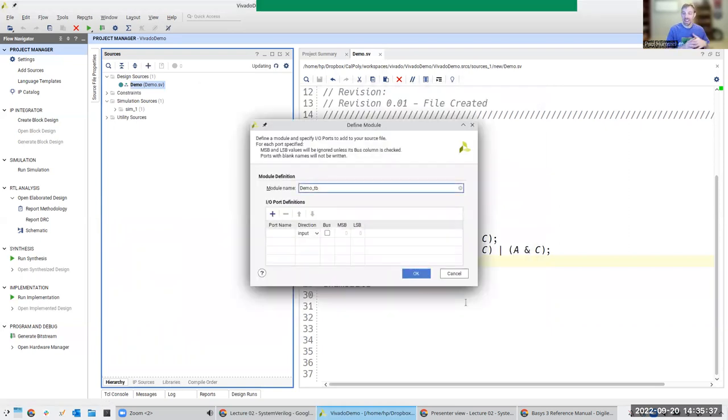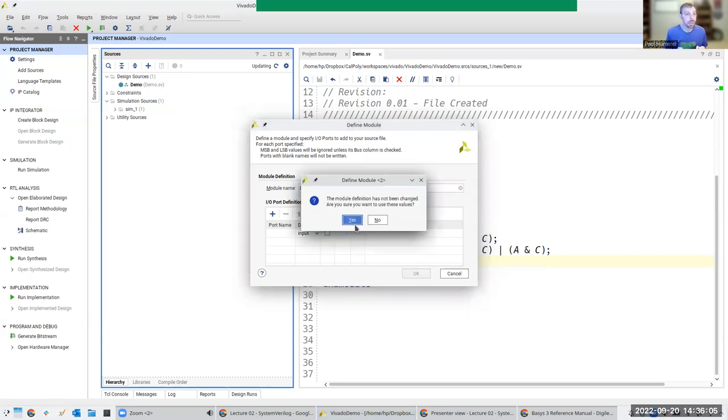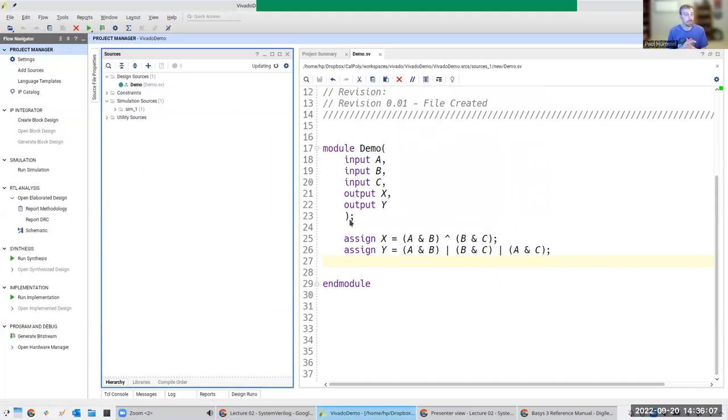Finish. Now, a test bench has no inputs and outputs, right? We create internal signals that we connect to the part that I'm going to test, but the test bench itself has no inputs and outputs, which sort of makes sense because on your workbench where you would be testing a part, you have no inputs and outputs coming in or out of my test bench. They're all internal, right? They're all signals and equipment that's on my test bench. Maybe that will help. So yeah, leaving this blank.